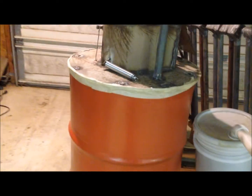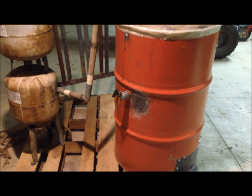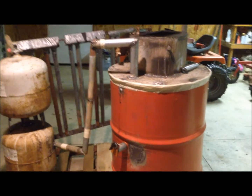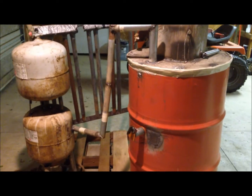The other things I found: the inferior metal I built the reduction zone out of — it needs to handle 2,000 degrees down inside and the thin sheet metal I used is going to warp and not be able to handle that temperature. My pipe diameter throughout is a little too small and I'm afraid of tar building up inside. I'm probably going to build a brand new gasifier after this — this will be my prototype, and I'll build a new one with all the kinks worked out.